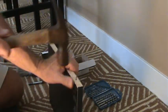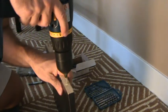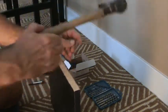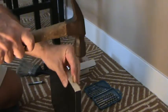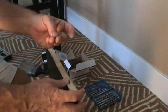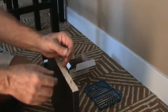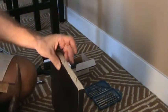See, now I've got the point of that nail sticking up — how do you like that? Then I do this a couple more times: one there, one in the middle — a couple more finish nails upside down. Tap them in and you can't put them any further than that because the nail head is stopping them. I was thinking about cutting the nail head off and slipping it in, but then the end could keep pounding deeper and I don't want this nail to go in any further.